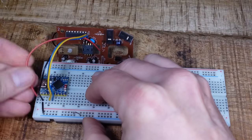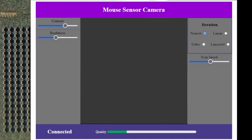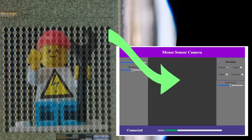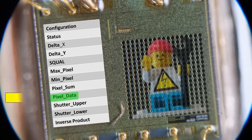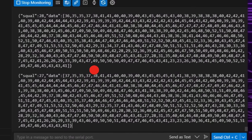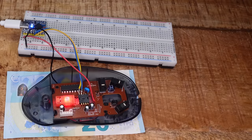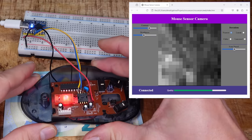Of course, ground and plus 5V also needed to be connected. To avoid reinventing the wheel, I reused the UI that I had made for the Blu-ray microscope. The challenge this time was to bring the 324 pixels from the mouse sensor to the canvas area of the website. The ADNS2610 features a pixel data register — writing an arbitrary value to it lets the sensor capture an image and write it to a buffer. 324 subsequent read accesses then dump it out pixel by pixel. The values are packed into a JSON array and sent to the website over wireless LAN. And there we can see the pixel matrix. I placed the mouse on a banknote and I am slightly moving it, and you can clearly see how the pixels follow the movement.